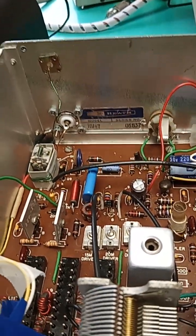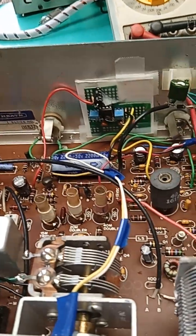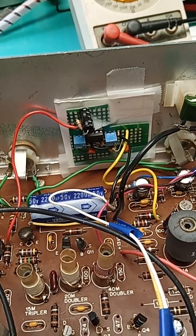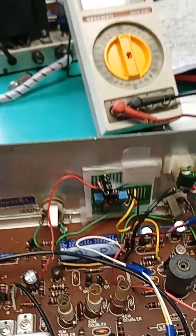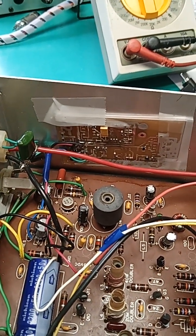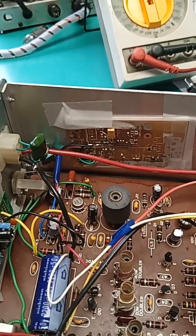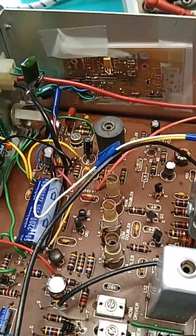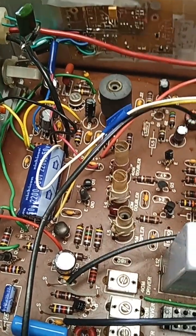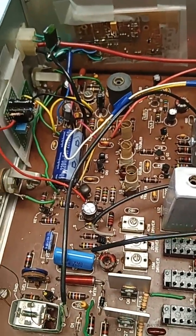If you want a real cool radio, this is it. Unfortunately Heathkit's not making kits anymore, because that was the thing — building and doing things. I added a cheap 555 oscillator sidetone in the back and a small surface mount amplifier for driving a speaker, taped them on the sides of the chassis so it didn't modify the circuit board. Very, very important: use a low temperature soldering iron, because use a high temperature iron and you'll peel the foil right off that board. So if you can find one at the ham fest, grab it — it's a neat little rig.